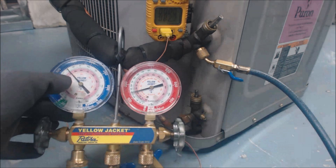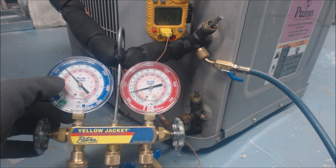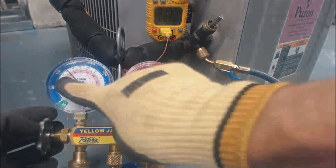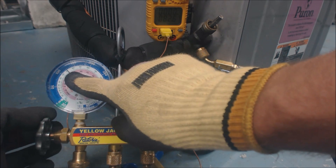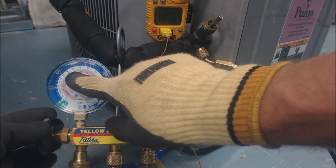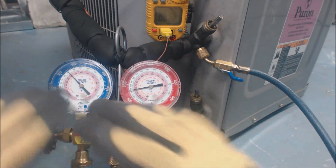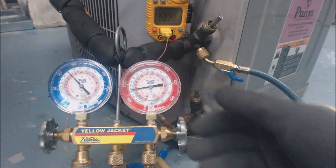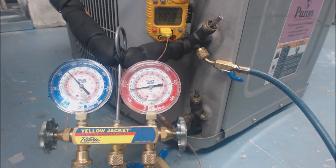During this process we've also made sure that our suction line temperature — the saturated temperature in the middle of the evaporator coil — is above freezing. It actually reads 41 degrees in the middle of the evaporator coil, so we are safe with that. We would just need to add just a little bit of subcooling.